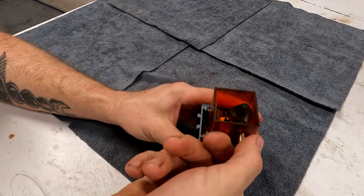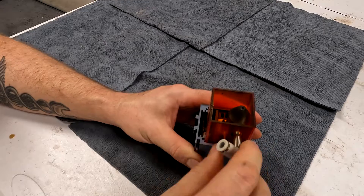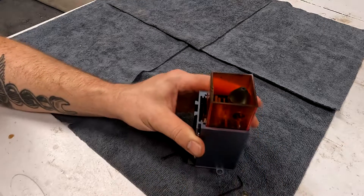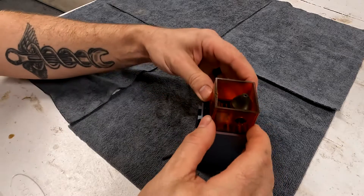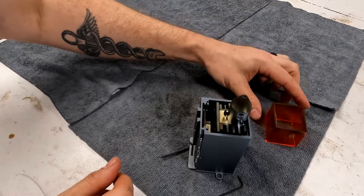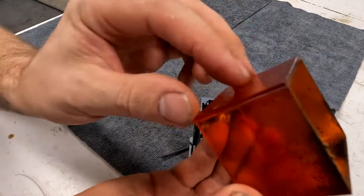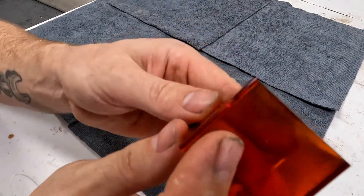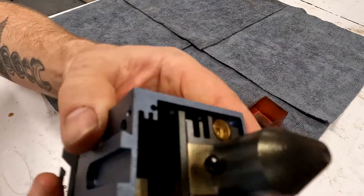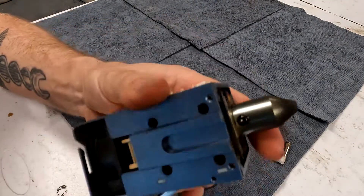The next thing I want to do on mine is unloosen my air assist. Again, yours may not have the air assist so you may not have to do this step. Once I get that out, the orange cover will slide right up and off. If not, check your screws and loosen them up a little bit more. As you can see by the resin buildup on the inside of it, you need to clean this off — it can hit your project, scrape along it, leave bad marks. The tip of it is also covered with resin.